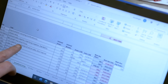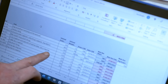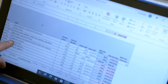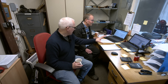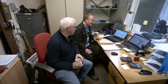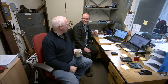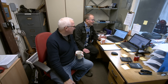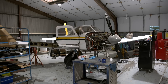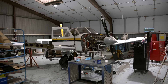We've got forward and aft wing attachment fittings to look at, in-situ inspection of control cables which is easy to do now with them all slackened off, and a rudder bar inspection. We've also got stabilator attachment fittings as part of an old service bulletin. It looks like this might be a light annual for ADs and SBs — we caught up with a few on the six-month, changed the vac pump. But as an owner you could find yourself stung with quite a bit of work having to be done, as occasionally a load of stuff becomes due at once. And by law this has to be done within these intervals, otherwise you can't sign the certificate. An airworthiness directive is mandatory.